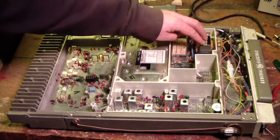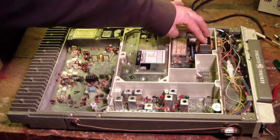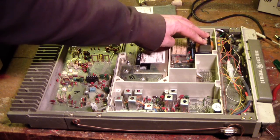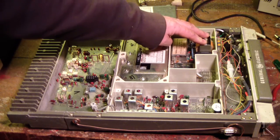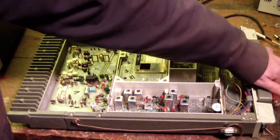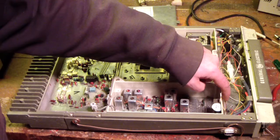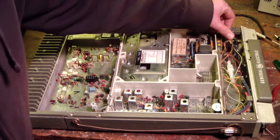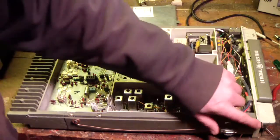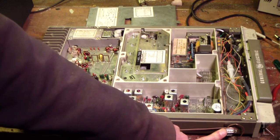This is the audio section over here. The receiver detector is in that little metal case. And then you've got an audio amp and audio transformer. They had a lot of audio power — they could drive a speaker in a dump truck and you could hear it. Up front here was interfacing. There was a front connector that would go up to a remote, but there were also header pins along here on all the lines. And I tapped in a control circuit and relay here, audio filtering circuit. I had a nine pin D connector on the side that I brought signals out to the radio with.